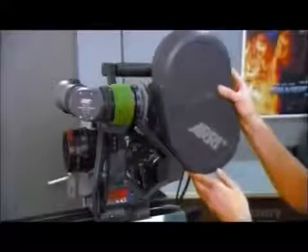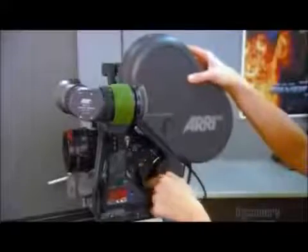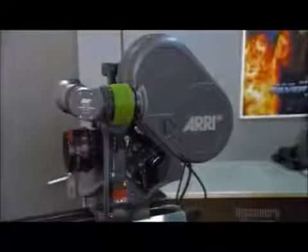With the camera's structure now complete, workers attach a magazine containing the film. A little nudge here and there leads the film down the right path. The movement swings forward to allow the film to run its course, and with the touch of a button, the film successfully races through the mechanical maze.